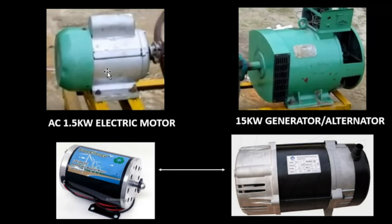I also mentioned the generator and the electric motor. For instance, if you are using this kind of tower generator, you will need at least a 1.5 kilowatt electric motor that has the power to run it. But if you have a 3 kVA generator and use a 1.5 kW motor, you are already consuming half of your output power, leaving only half — and if you add appliances, everything is gone.